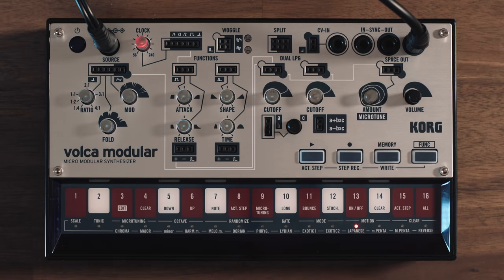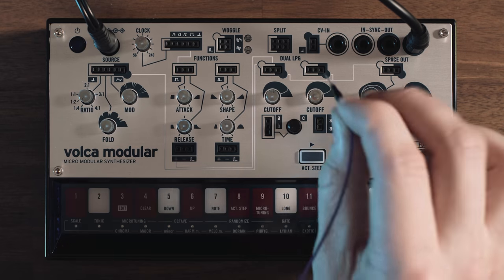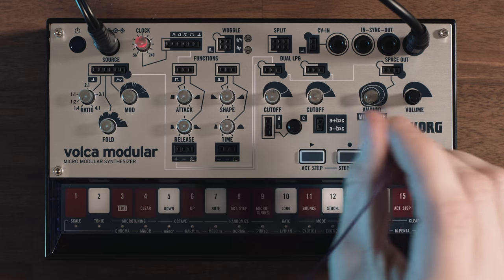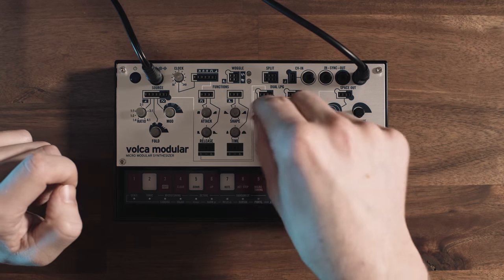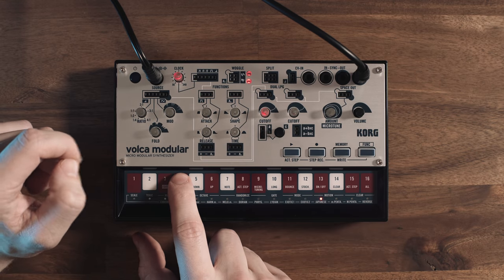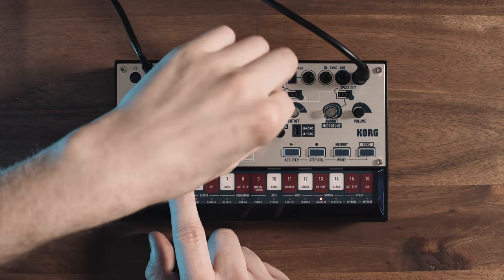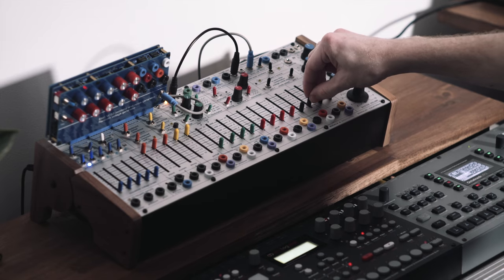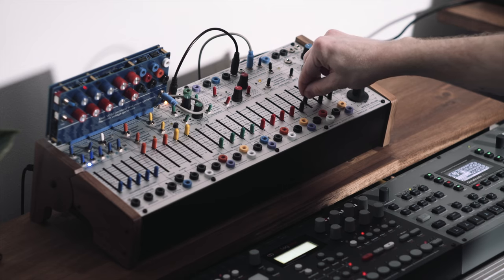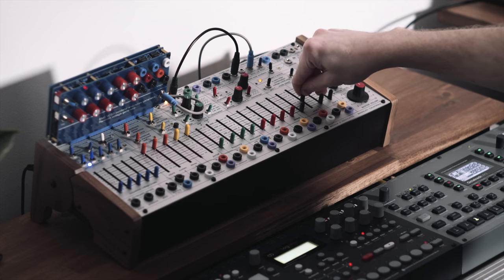As you can see, there's actually a second low pass gate — that's why it's called dual low pass gate. Right now there's no signal coming into the second low pass gate by default, but we could grab any signal and put it into the input, and then it would enter the chain and also go into the reverb. Let's have a listen at first to the source section — the oscillator section — which in a dry state sounds like this. And here we can listen to the behavior of the low pass gate as it opens and closes. For comparison, we can have a listen at me doing the same thing on my Easel — this is the pure wave and the behavior of the low pass gate. Fairly similar so far.